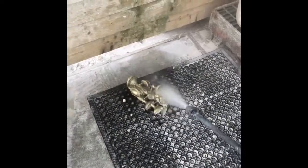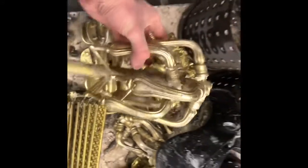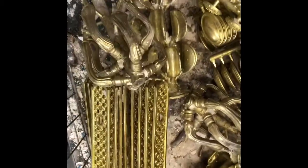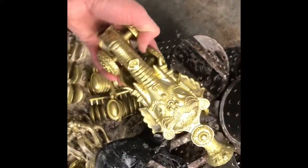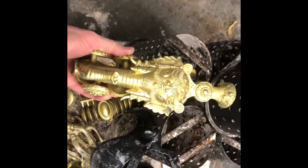I use the jet wash inside the metal flasks to get away the investment from the metal castings. Once the metal casting has come out of the flasks it will have investment all on the sides, so I'll use the jet wash to thoroughly clean them. And there you go — there you have the metal castings. Yesterday that was a wax door handle pattern and now it is metal. These are all the other ones I put in with it — as you can see they look really good, and we can create any design through this process.